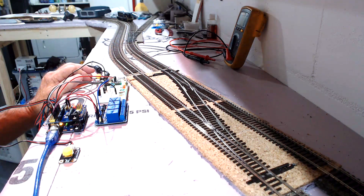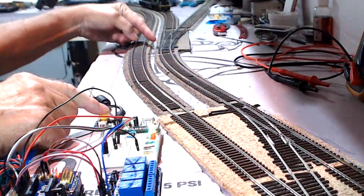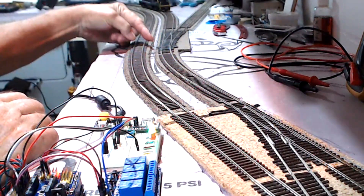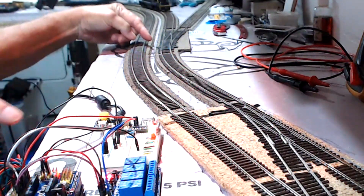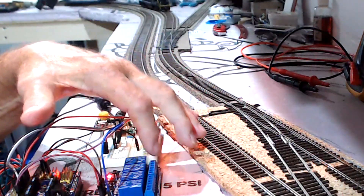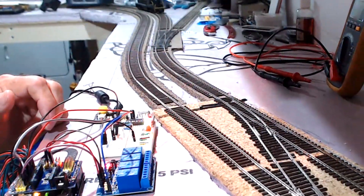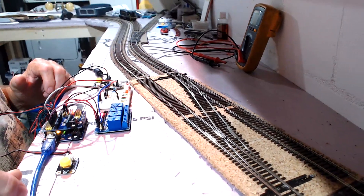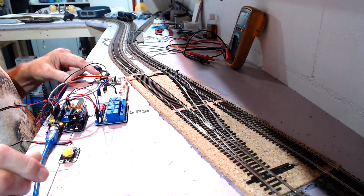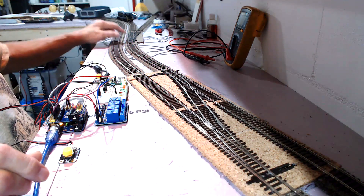The sketch calls for it so that if I press the push button, it'll change from the closed position to the thrown position. Watch this one right here. Let me push the button. It's throwing — it changes to red, and you can see this relay actuates. This relay actuates, so it'll change the position from normally closed to normally open. Now the points are closed on the normally open side of the relay. Let's push it back again — and it goes back to the closed position.